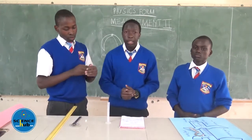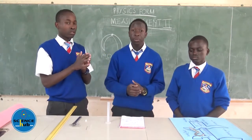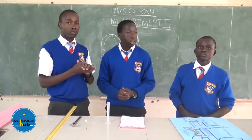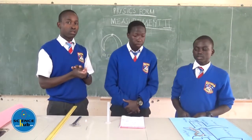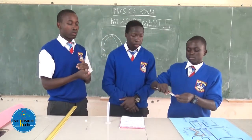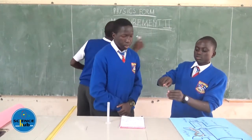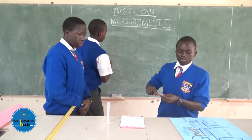So, in this chapter, you shall also get to know more about the zero error. There are two types of zero error. We have the positive zero error and the negative zero error, which my colleague Daryl Onyango is going to tell us more about. In the positive zero error, the zero mark of the vernier scale is towards the right of the zero of the main scale. To show this, we can use a diagrammatic representation.